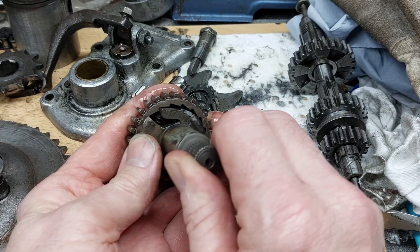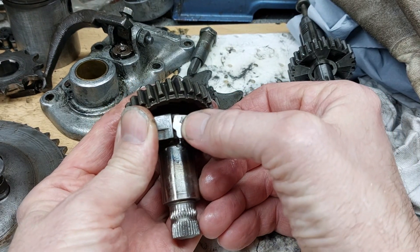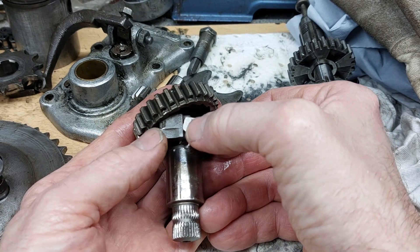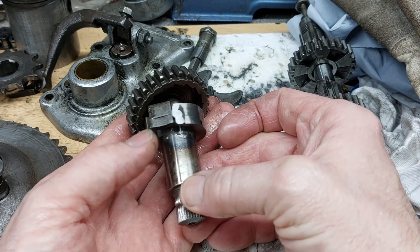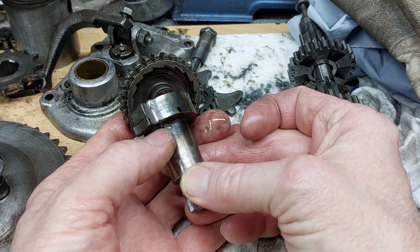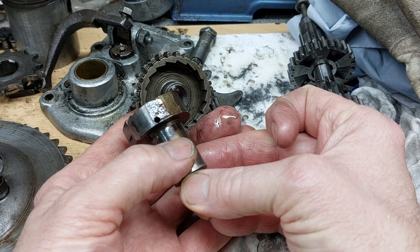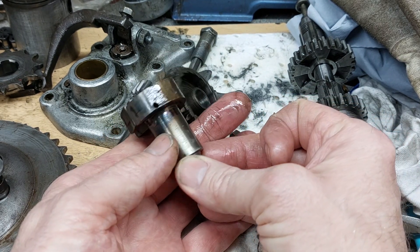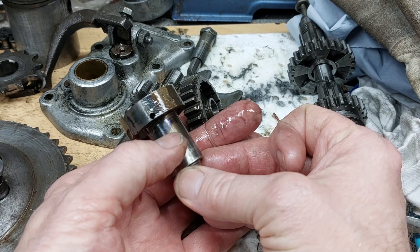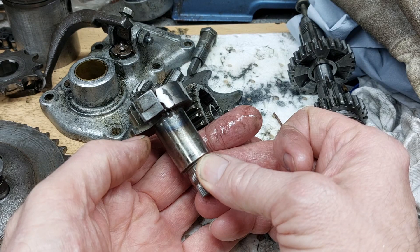So what I will do is run another bead of weld down here just to try and build this backing lip back up again — it needs to come all the way along. And then what has come out when welding it — you can see the crack, although it wasn't visible before where I welded it, you can see the crack spreads right round there. So what I'm going to do is grind it a little bit further out, maybe put a little hole in the end of the crack and then weld that back up and finish it off. And we should be done.